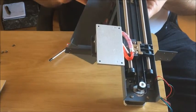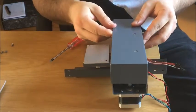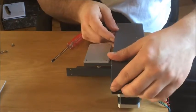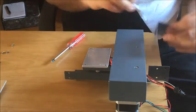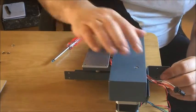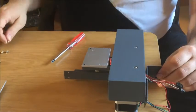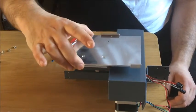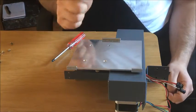Once you've done that, tighten all your screws back up underneath, pop your top cover back on, and refit all your screws. Don't forget to put your bracket back, and remember the longer screw goes in this corner here. Put the other three screws in there, refit your base, and reassemble into your printer.